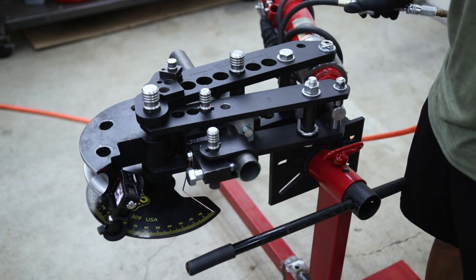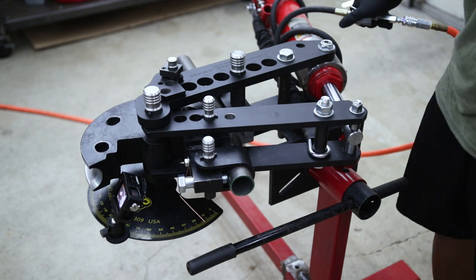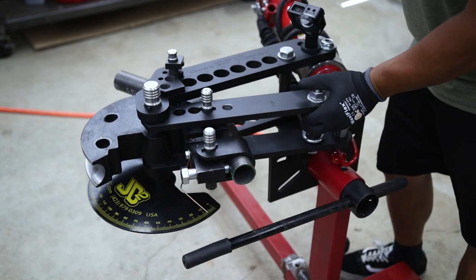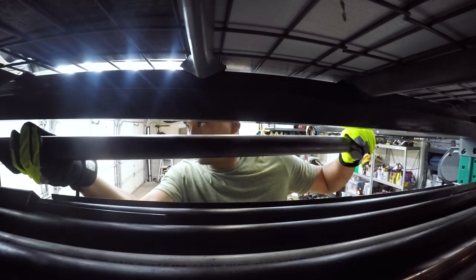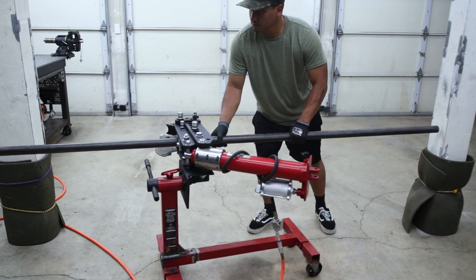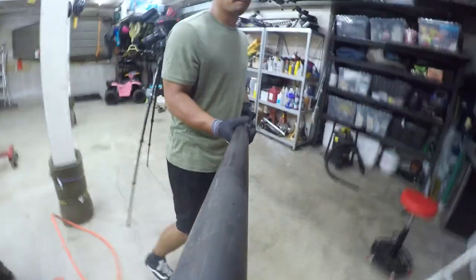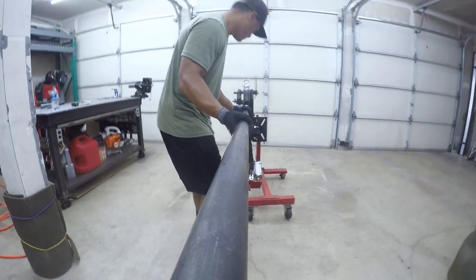Now let's run some tubing and see how this all bends. I was originally using a bolt as a pin but switched to a hitch pin — when the tube bender was moving it bent it a little bit, but I was still able to make it work. Let's try some longer stuff — say you had a 20-foot stick and you're building a roll cage; bending in the horizontal position would be tricky. Flipping to the vertical position works better, letting you bend something long upwards and take advantage of vertical space when you don't have the horizontal space.